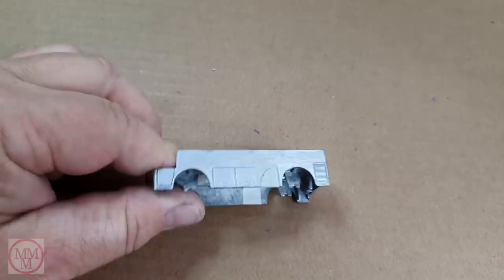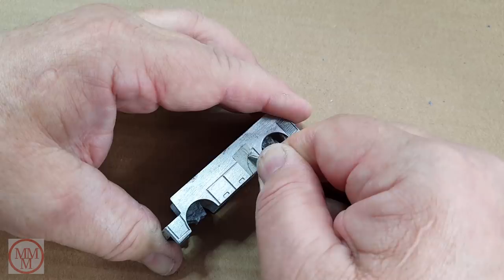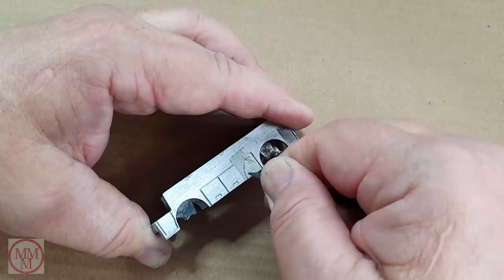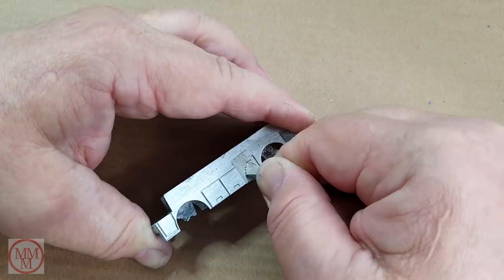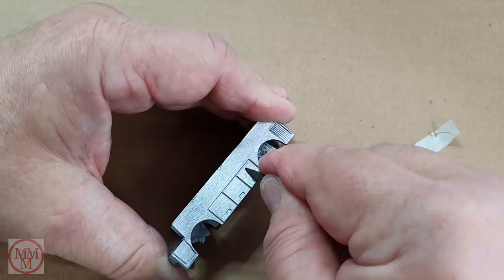Now I'm using this pointy file here just to mark the casting with a few little key markers that I'm basically going to join the dots up after I've done this. So I'm just making some little scuff marks there on that pencil line. And when it's finished, I can peel that paper off and just freehand it very carefully, try and get a nice constant arc there and something to grind away at quite accurately so I don't have to think about it.